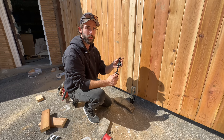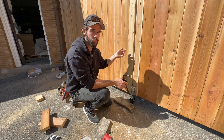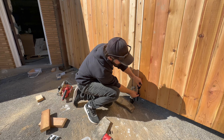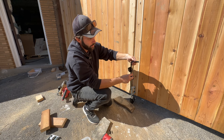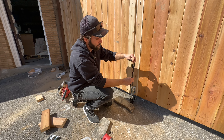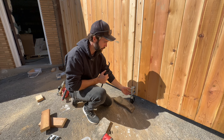This is the cane bolt we purchased from Home Depot. The idea is you screw it onto the gate that's going to be fixed. We have two gates but only want one operational at a time, so to keep one still you use a cane bolt. Once the gates are perfectly straight and in line, you mark the ground, drill a hole, and this slides up and down. When you want to open that gate to drive a vehicle through, you pull it up, spin it, and it latches. We ended up taking one of the casters off because our driveway has such a slope that even with the wheel the spring becomes too tight before it's fully open.